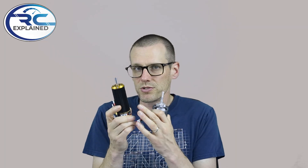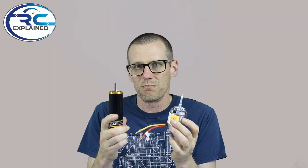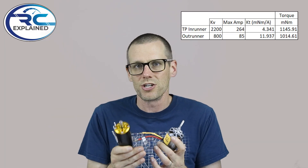I have a bunch of motors here in front of me. I'm going to pull a couple — an in-runner and an out-runner. Between both of these brushless motors, we have an 800 KV on our out-runner and a 2200 KV on our TP brushless motor. Most of you have probably heard of the TP brushless motor, as it's commonly used in radio control cars and speed run cars. Now with a 2200 KV versus an 800 KV, you might think this motor is going to produce more torque, but that's not necessarily true without looking at the amount of current we actually push through each one.